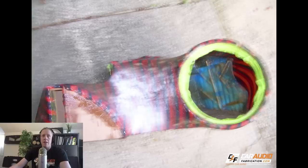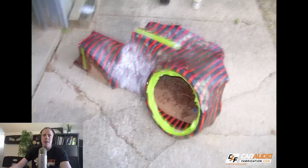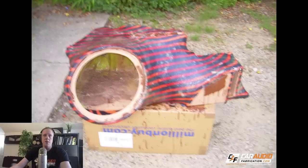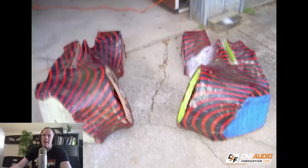At this point I added some staples along the edge to really secure it, staples around the edge of the port, and I also started applying chop mat on top of the resin surface to give it more strength. I applied some tape around the insides of these different shapes to protect the wood underneath and hopefully save some body working time by being able to peel away the tape. I ended up not even pulling the tape off until much later in the project because it was just so difficult to do so.